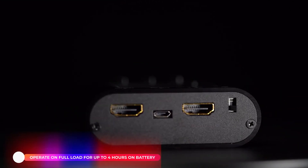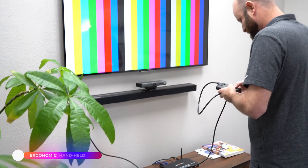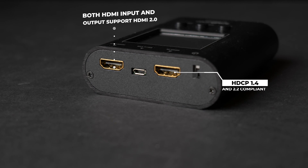The features of this device are actually pretty jam-packed for something so small. It supports a maximum resolution of 4K/2K at 60Hz. The AVTPG Mini can generate and analyze signals at chroma subsampling rates of up to 4:4:4 8-bit and 4:2:0 16-bit or HDR. This analyzer is HDCP 1.4 and 2.2 compliant, which allows users to test a wide variety of 1080p and 4K HDMI devices.